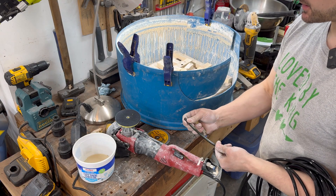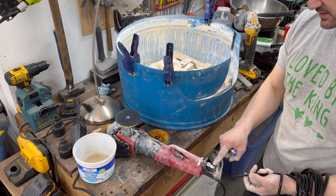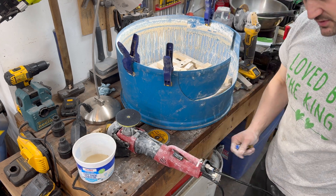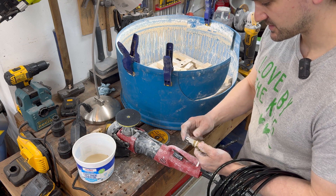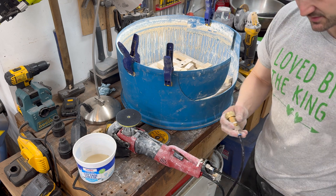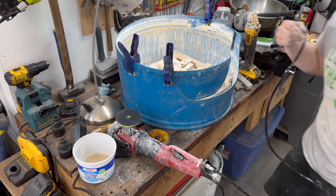This polisher came with some 8mm air hose connectors, but the fittings are not going to work with anything here in the U.S. So what I've done is get an 8mm Quick Connect that screws onto the polisher — that allows me to plug in this water hose, and that's watertight. I also set up a garden hose adapter: another Quick Connect fitting with a standard garden hose female fitting that just pops right on. The air hose that it comes with is about 8 feet, but for another $12 I picked up a 30-foot hose, which allows me to more easily reach my water hookup in the shop.